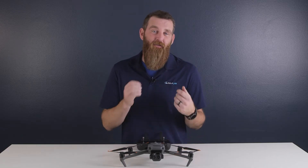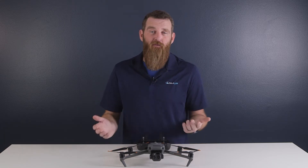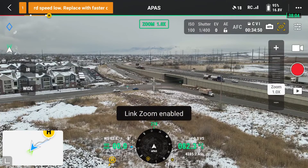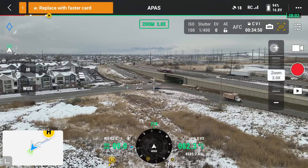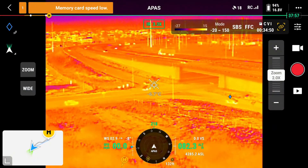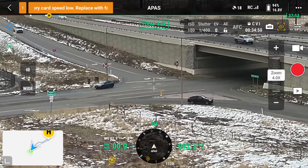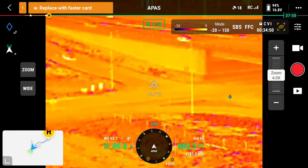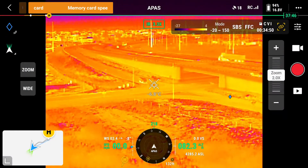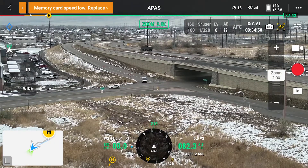Next, let's talk about the zoom link feature. Once again, this is a feature that those who have already flown an M30 series may already be familiar with. The zoom link feature makes switching between payloads easier by locking the field of view between the thermal and optical camera views. Of course, the resolution of the thermal view when zoomed in will be greatly reduced when compared to the optical view, but for search and rescue operations, this feature could save a lot of time and trouble by keeping targets centered across all of the cameras with the same field of view.